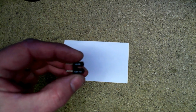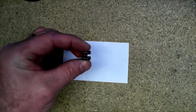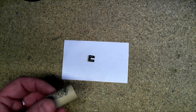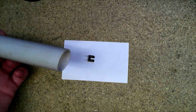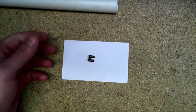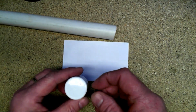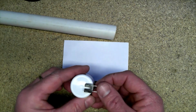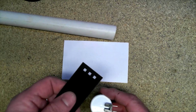I also said I needed a switch. Photo transistor. That could be used as a switch. This is the TCST1103 photo transistor. I wanted a float switch. So, corks float. I'm fortunate enough to have a piece of 3/4 inch thin wall PVC that handily fits the cork. Probably wind up cutting a slot in the top of this to do a little photo interrupting with something like this. We'll see how it turns out.